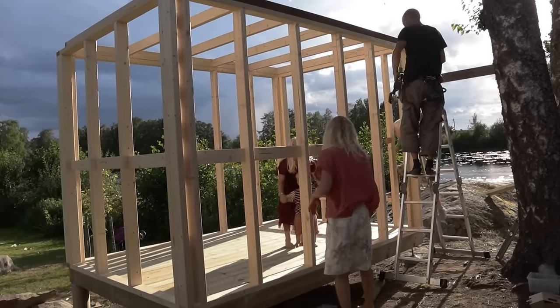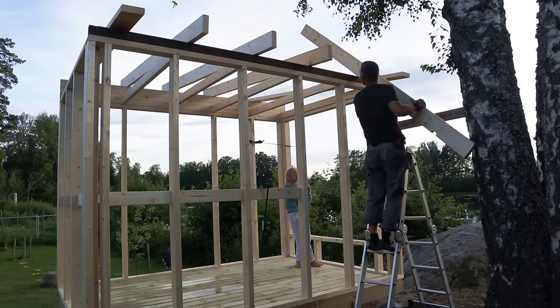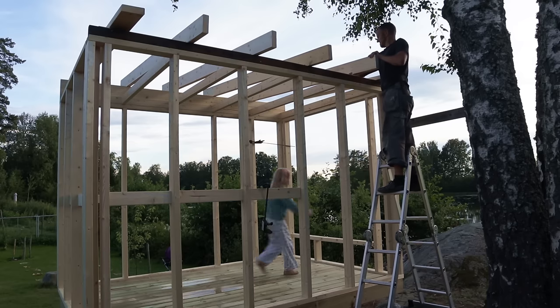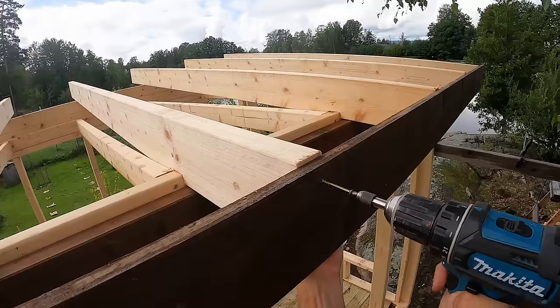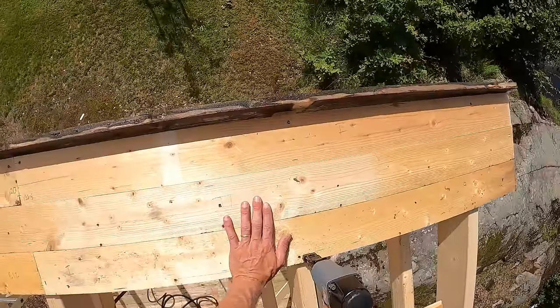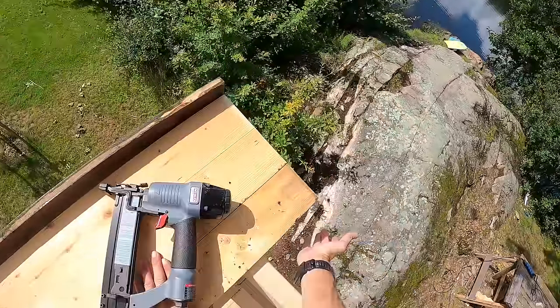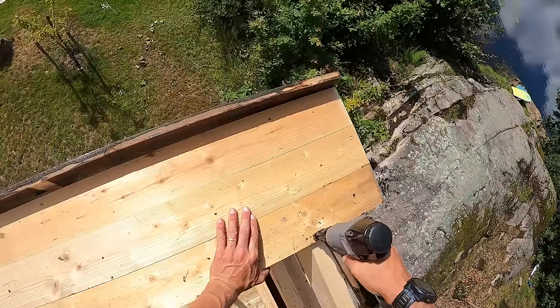I've chosen to do a flat sloped roof. I think it's the easiest to build, and the roof is really small. A sauna guy once told me he installed a pipe in the lower part of the roof and had some problems with ice building on the upper side of the chimney, eventually leading to a shower party inside. He probably did more things wrong, but I will place my oven and pipe under where the roof is highest.